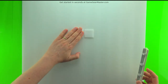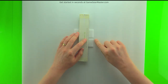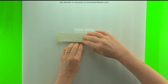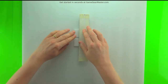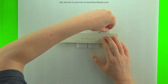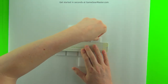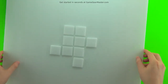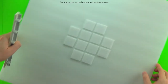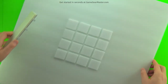The procedure is the same: glue down the first tile where the two lines intersect over the X, let it dry a little, then turn and place the next. Get those first four squares in on the same side of the crosshairs to ensure you spiral out evenly on each side. If a square is a little malformed, it's okay — totally fine. The fourth one goes in and then we start the procedure: turn 90 degrees, place a square, check it vertically and horizontally, and repeat. The only difference with the large tile is at the outside edge there won't be squares hanging over.